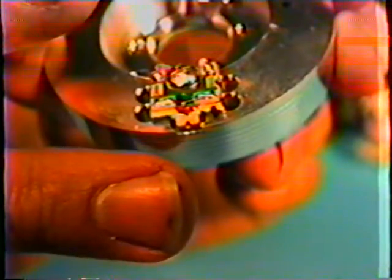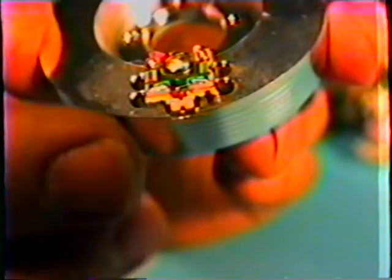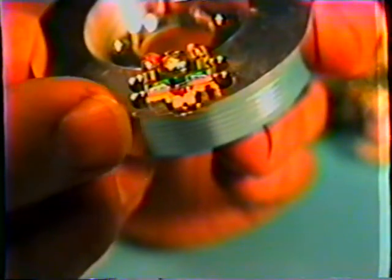What will that do to your picture? Remember the picture that we had on the VCR before we started cleaning this? How it was very snowy. There was a picture there, but very snowy. That's what this one did, because one side was good and one side was bad. It was a little bit of a picture, but very snowy and raspy. And the cleaning didn't do it, so then you suspected deeper problems.